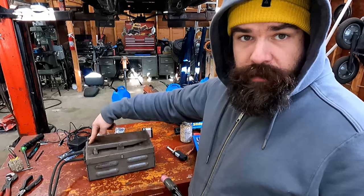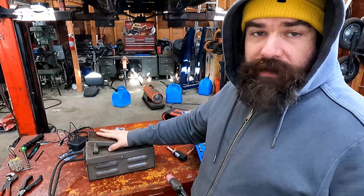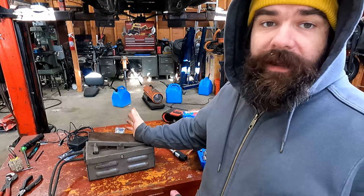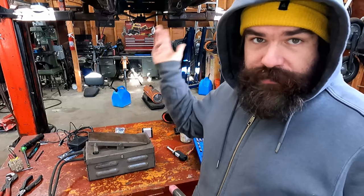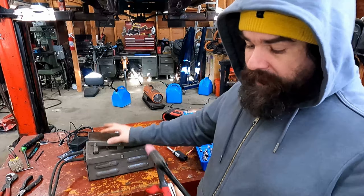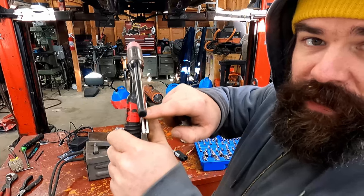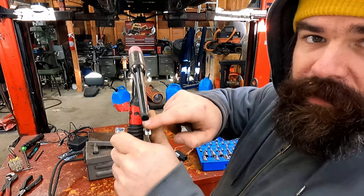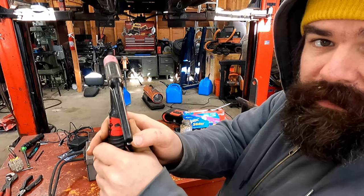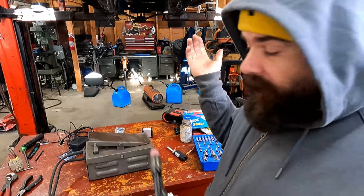Now, a foot control, you use your foot to operate it. These controls are great at a bench. They give you a lot of control. But if you're standing underneath a car or in an awkward position or even laying on your back and you want to weld up some exhaust or whatever, this becomes a difficult option. And what's a lot nicer would be a hand control. So in this case, it's going to be a little linear potentiometer, possibly with a spring return that just sits right there. And you'll be able to drive it back and forth with your thumb as you're welding to control it, just like you would with a pedal.